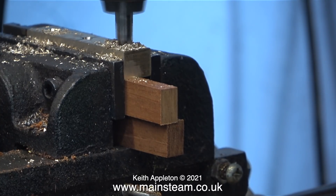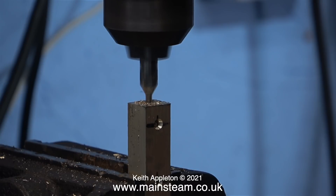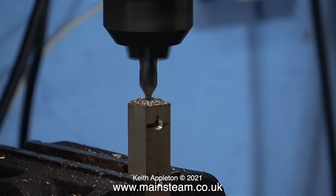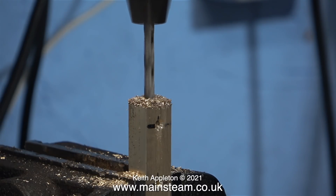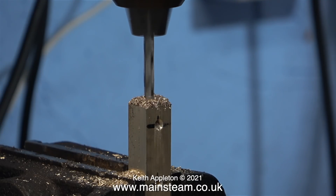After centre drilling the three holes needed for the taps, I'm now going to drill the hole right down the middle. In this clip I'm using a piece of hardwood to make sure the metal is perfectly vertical. A centre drill first, centering the hole deeply to guide the twist drill bit. After the centre drill I'm going to use a pilot drill which is three-sixteenths of an inch in diameter, and I can monitor its progress through the work by the swarf leaving the holes.